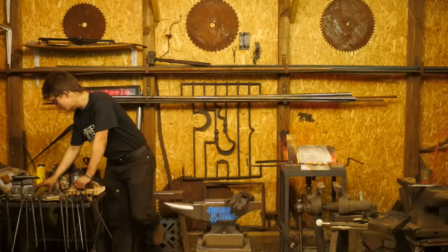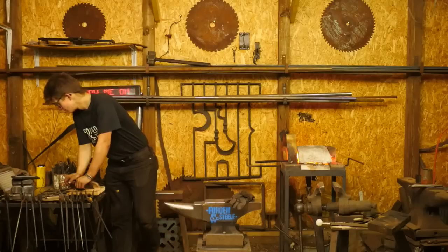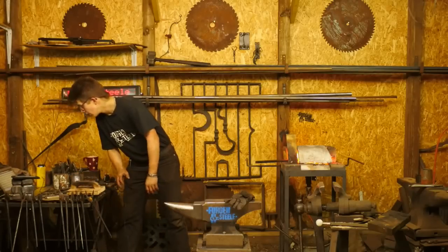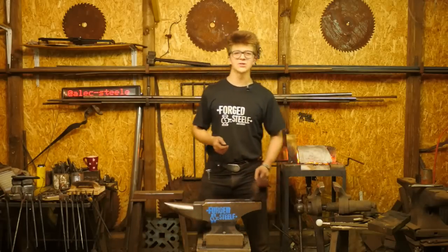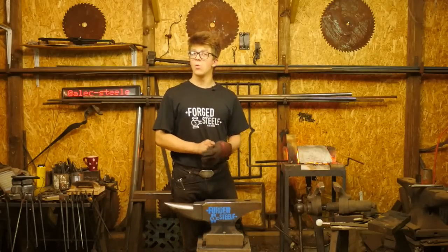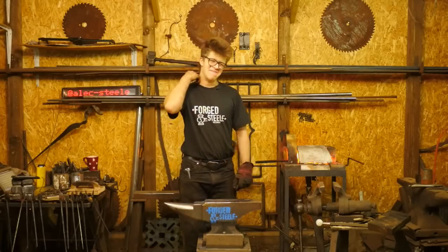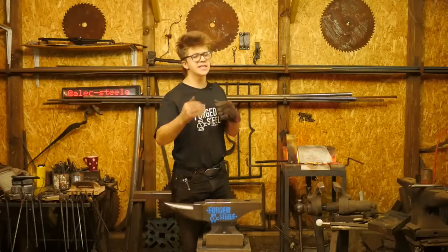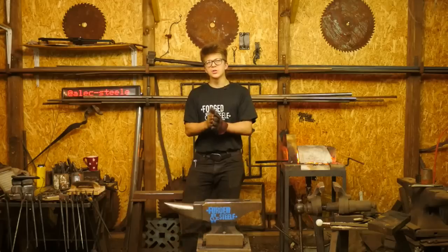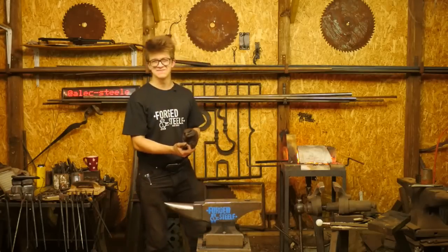How's YouTube doing? How are you guys doing on YouTube? Lars Mermans on YouTube is asking about what steel I use for my hammer eye drifts. Well, for the hammer eye drifts, it depends. Certainly, because the hammer eye drift is heating up to a high temperature and having a large amount of pressure exerted upon it, we do not want to use mild steel.